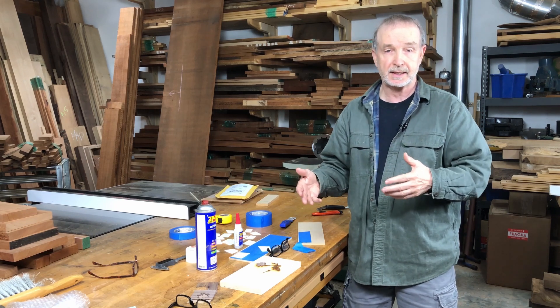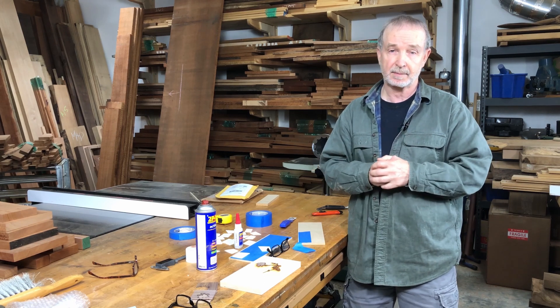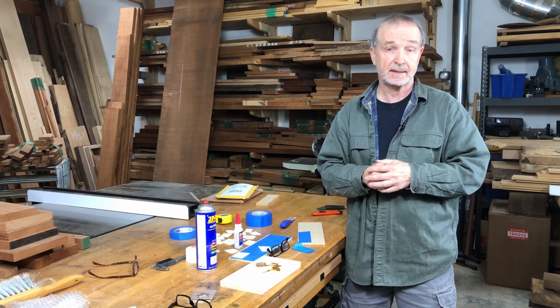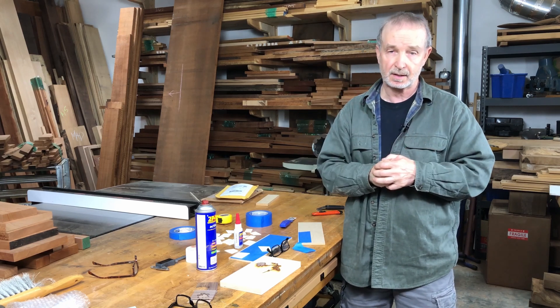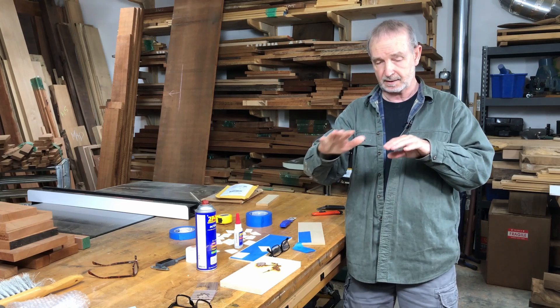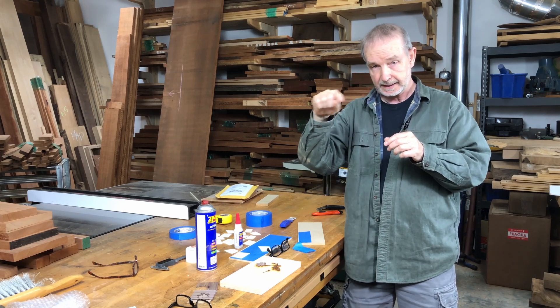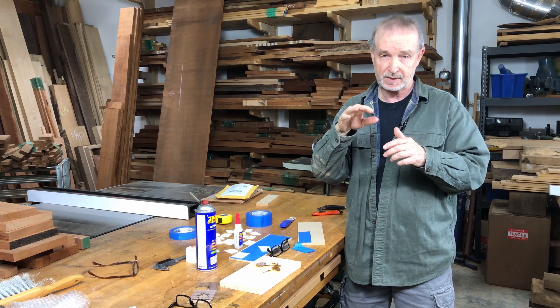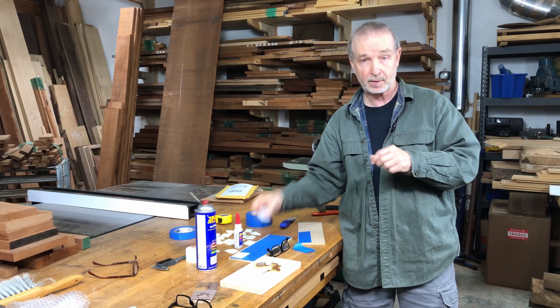The technique I'm going to use today originally came from a friend of mine, David Micah. David Micah is one of the best custom guitar makers in the country — his website, Micah Guitars, you can go see his work. One of the things David does is incredible inlays in the necks and headstock of his guitars, such as a butterfly where each individual feather is cut and glued on. It looks incredible against that Gaboon Ebony fretboard surface. Essentially, he cuts out the hollowed-out area — usually referred to as a socket — with a CNC, and then cuts out the parts of the Mother of Pearl that'll be inlaid in there.